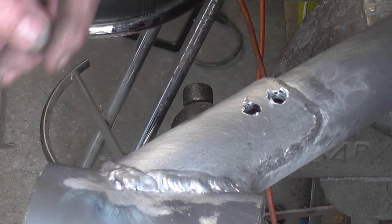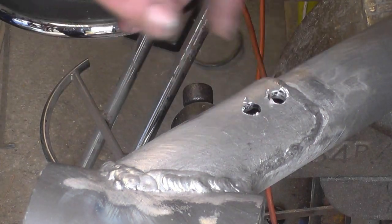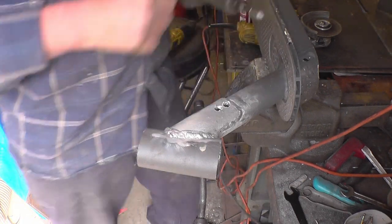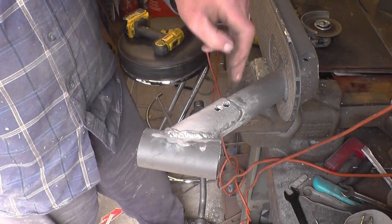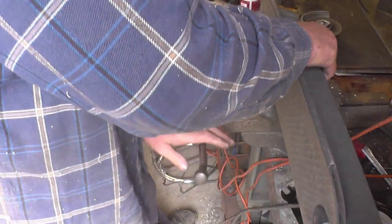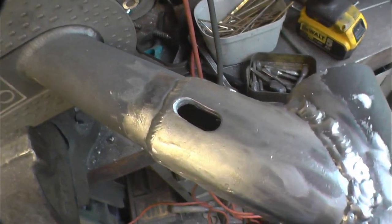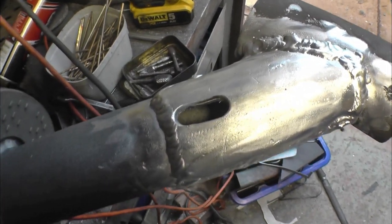It's welded, not too bad. There was some shite pulled through — some bits were really good and some bits were terrible, but it certainly isn't going to go anywhere. I'll put a milling cutter in there right now and open that slot out. What it wants is some WD-40 on there, but I don't want to do that until I've finished welding. I can spot through those two holes onto the side and then put the slots in later on. Using the cutter dry locks it up — the WD-40 really does help. That's it welded together and the two slots cut in. It's not my best job, but it certainly isn't going to fall off. Some of it welded really nice, other bits I was shite at. Where it welded nice, it's really nice.